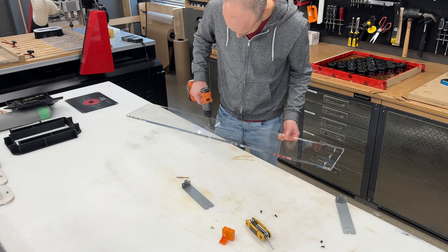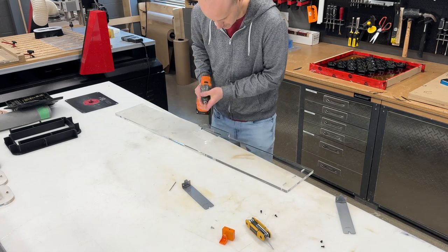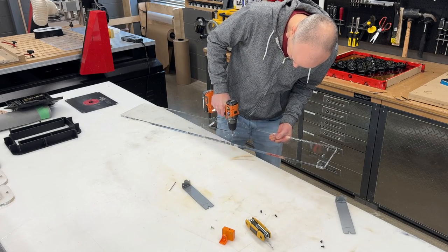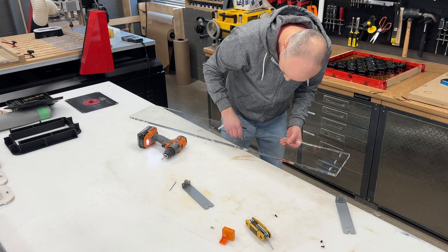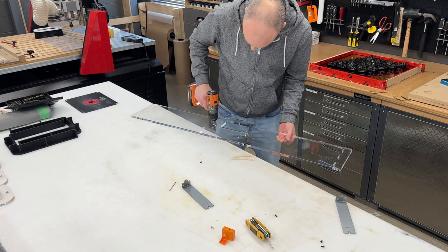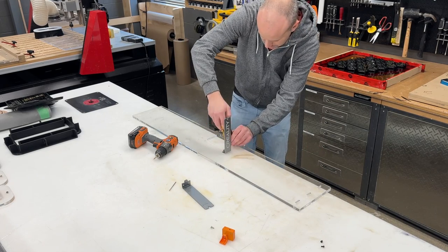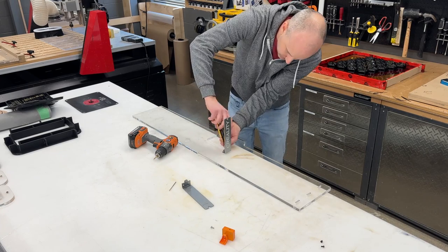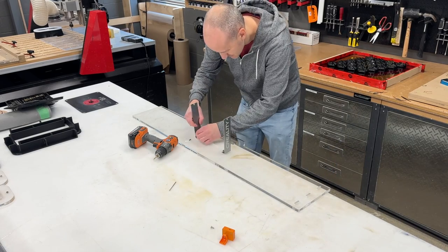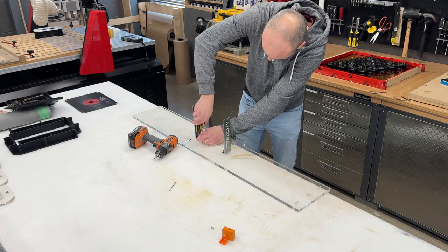In the end all I cared about was the final product getting it working so I didn't have to keep changing my filament out every time. What I'm doing here is drilling out some bigger holes so I can mount those rail holders that I took apart from the Creality filament holder, and then test fitting the screws — which I think are M4 thread — so I can thread them right into the acrylic. But like I said, I over-threaded them and they ended up getting a little wonky. In hindsight I would have made the holes bigger or used brass knurled inserts pressed into the acrylic and then screwed into those.